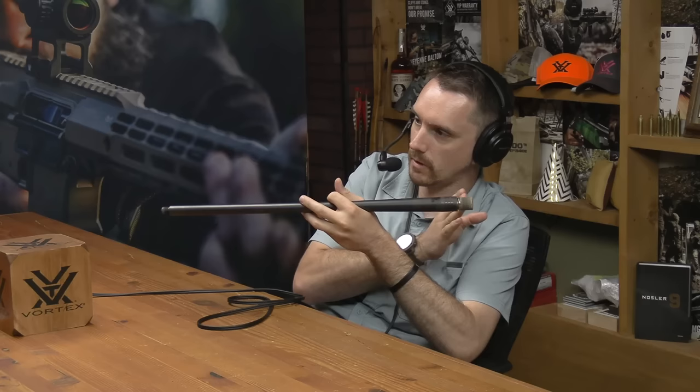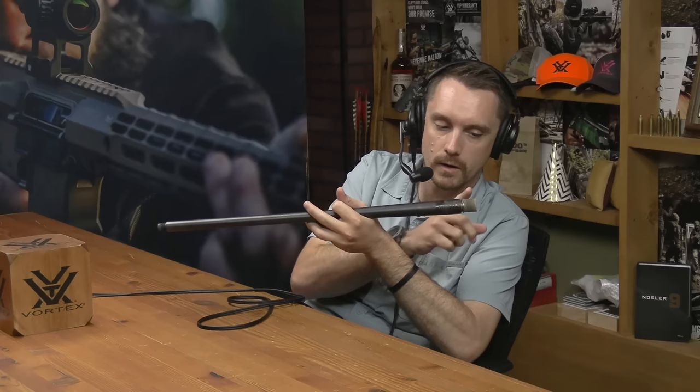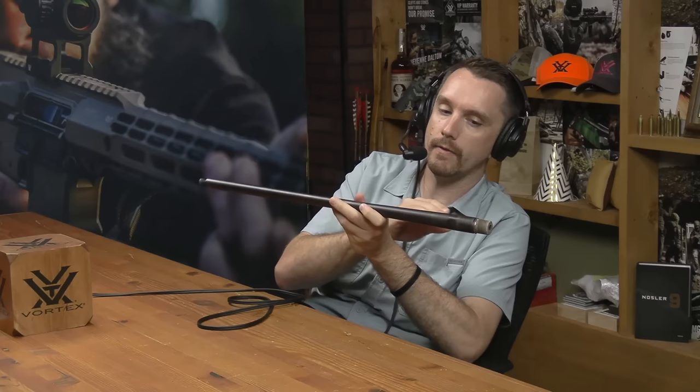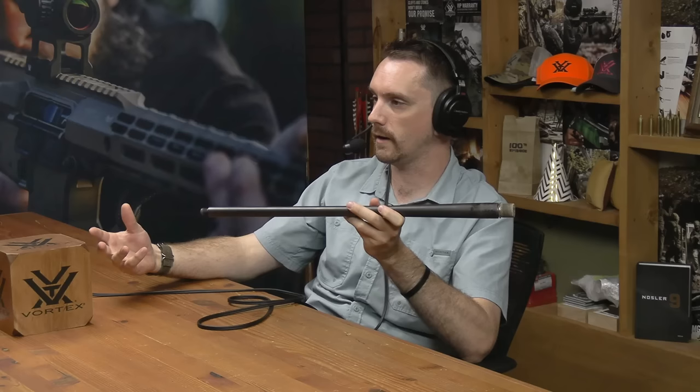So we have our threaded shank here where the barrel screws into the receiver, and then we have what's called our shoulder, where the barrel buttresses up against the front face of the receiver. Now, not all guns have a shouldered barrel. Some use a barrel nut or a collet type barrel nut to control headspace, but this helps us control headspace. Depending on the diameter of that shank, we could cut part of that off, rechamber it, rethread it, reshoulder it, and set the barrel back. In which case, depending on the severity of that throat erosion and the degradation of the lead and all that stuff going on right forward of the bullet, we more or less refresh the barrel and refresh the chamber. And then all of a sudden we breathe new life into a gun just by setting it back. And not a hell of a lot, too.